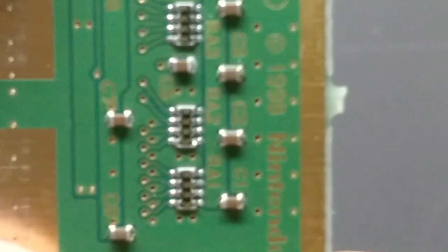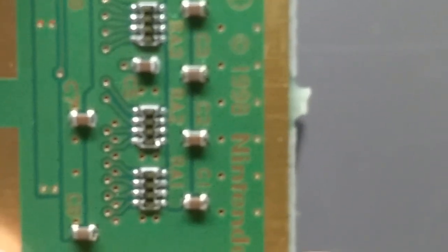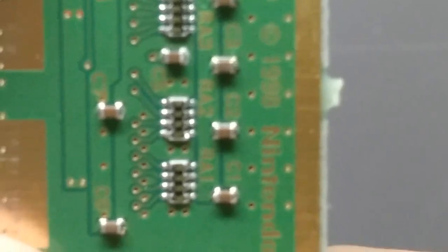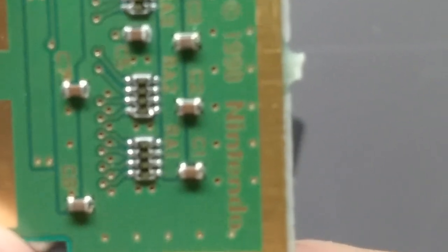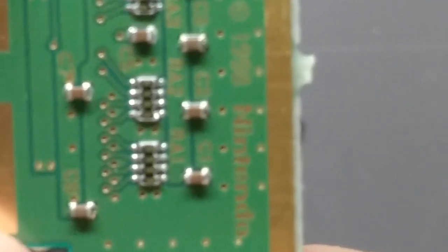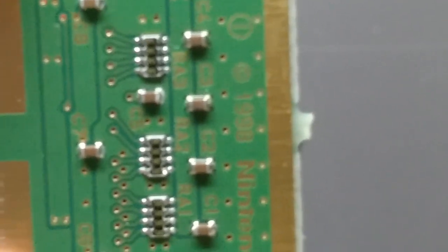I'm going to check around upstream and downstream of that and see if there's anything else funky. I don't think so. And I guess I can just kind of bodge a resistor over the top of that somehow and disconnect. Yeah, just bodge over the top, I guess. It'll take the path of least resistance, I guess. Anyways, let's see if I can find a resistor that'll match that.